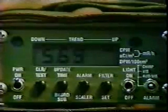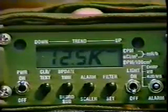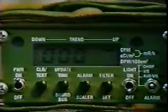To prepare for an x-ray mission, check the x-ray probe operation. Set the meter to filtered mode and two-second update. Set the probe to peak aligned and place the test sample under the probe, x-ray side facing up. The meter should display 8,000 to 16,000 counts per minute above the average background counts. Remove the test sample and reset the probe energy to the desired kilo electron volts. Set the meter to the unfiltered mode to allow recording of the background count. X-ray surveying and monitoring is performed with the extension handle positioned to maintain the probe at 12 inches or less above the surface.